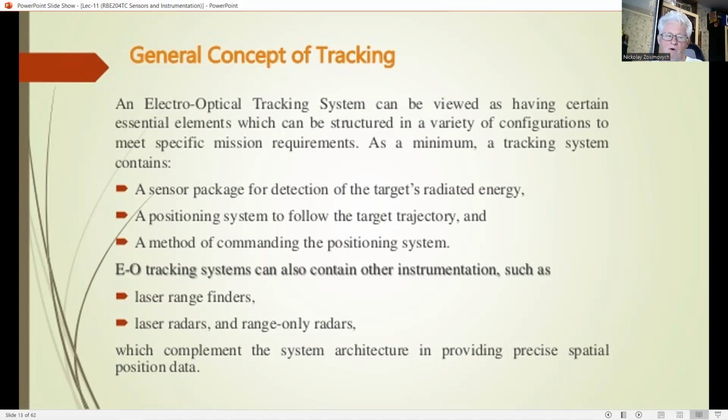At startup of the tracking process, the object position is usually not known. Therefore, first a search is performed, in which the environment is scanned by either the transmitter or the receiver, until the receiver gets a proper signal back. Once the object has been found, a tracking algorithm controls the transmission path to follow the movement of the object.